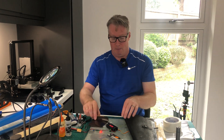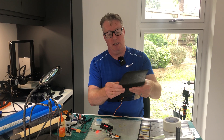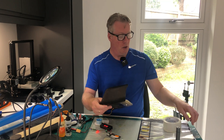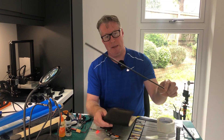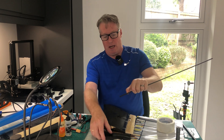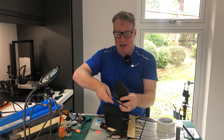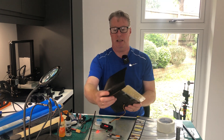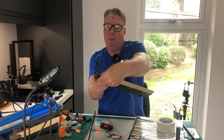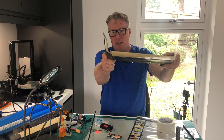I'm also not particularly happy with the way the winglets attach to the wings. The screw that goes through the wood into the inside is almost next to useless after flying and crashing a number of these models. So I'm going to try to make them more rigid using some 5mm carbon fiber tube — cutting maybe 30mm of length, inserting it through the normal screw hole in the winglet so it protrudes slightly out, then embedding that carbon rod into the actual wing. Eventually I'll have two carbon rods where the screw holes are, holding the winglets in and stopping them from flexing.